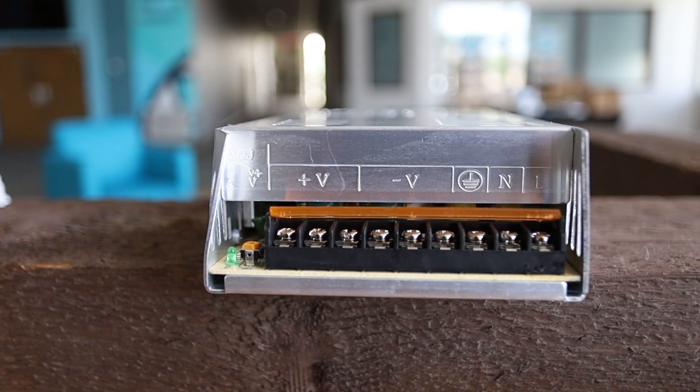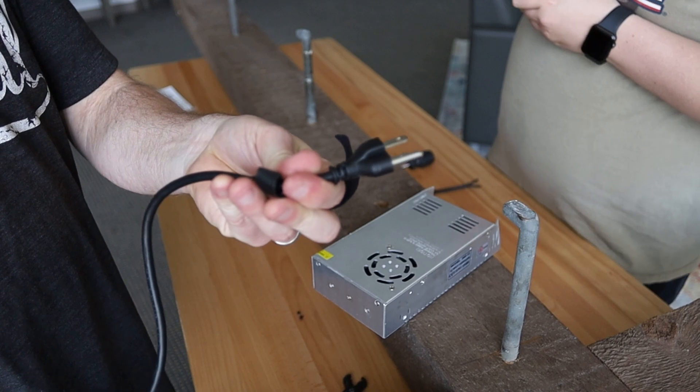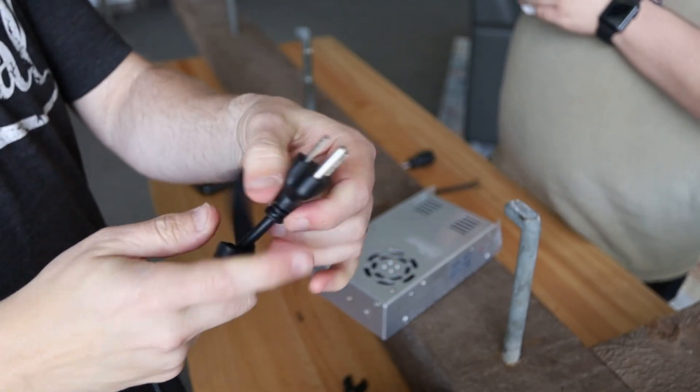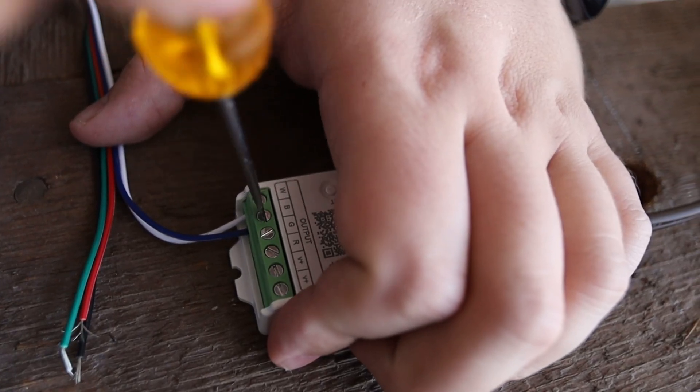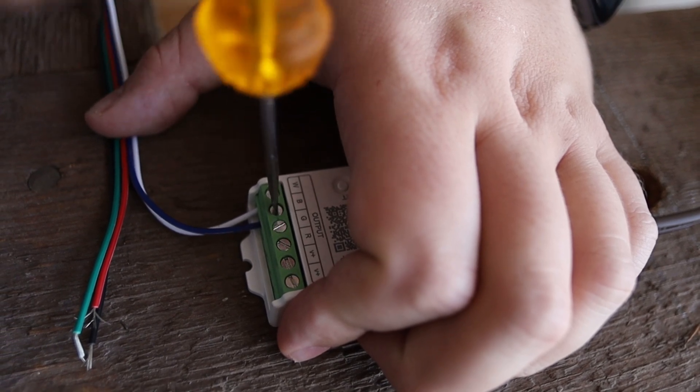For the power supply, if you've never done these before, you're essentially using extension cords and chopping the ends off to make them work. An old two-pronged brown extension cord was perfect for the output and just an old IEC cable chopped to length, because we have a power outlet right behind that cross that we installed on a switch. Be sure that as you solder things throughout the process you're incrementally checking that all of the colors are still connected correctly and nothing is screwed up before you keep going down the chain.